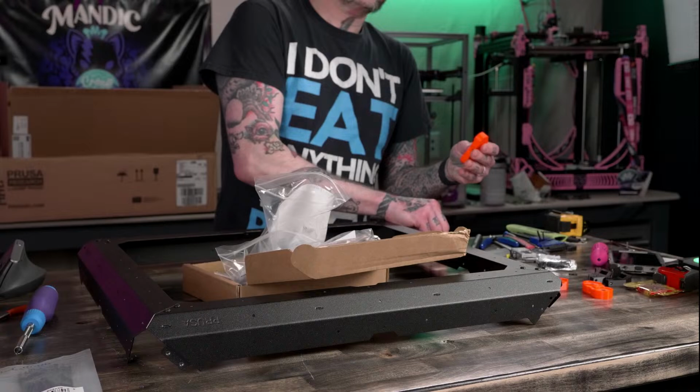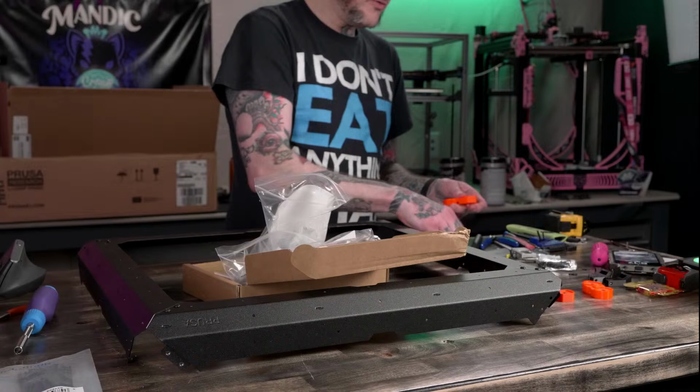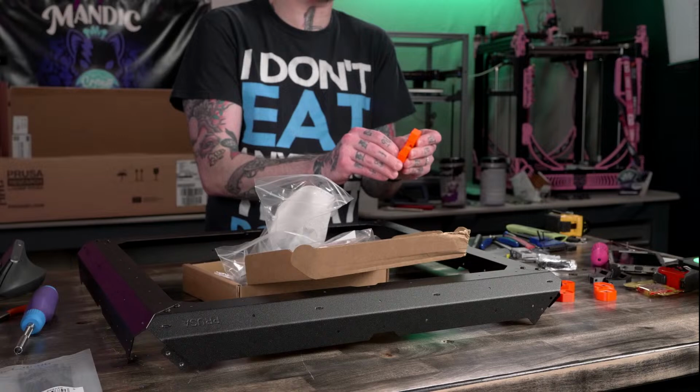It'd be great if you could order a Mark IV kit with PC blend CF printed parts instead of PETG. I don't know if PC CF is the right choice for all parts. ASA, ABS, maybe, don't know. I know some folks have found that PC, I believe, creeps more than ABS and ASA does over time, so that's why it's not really recommended to print your motion system parts on a Voron with PC.